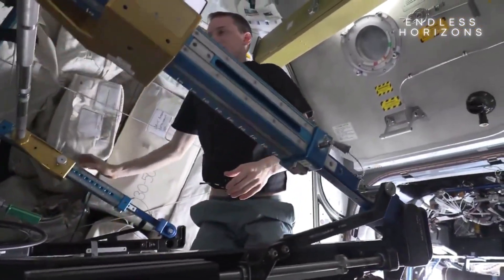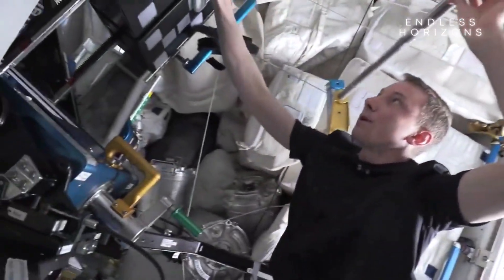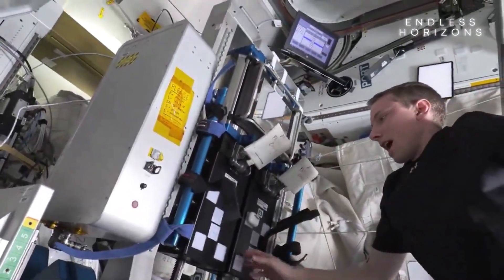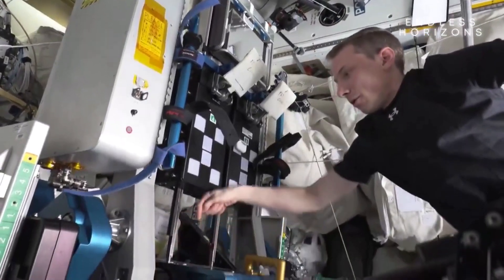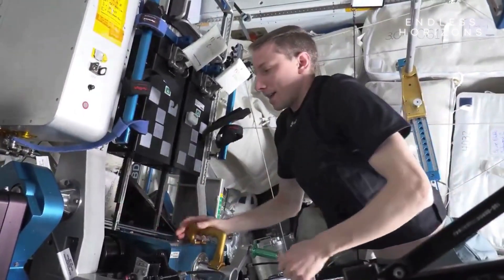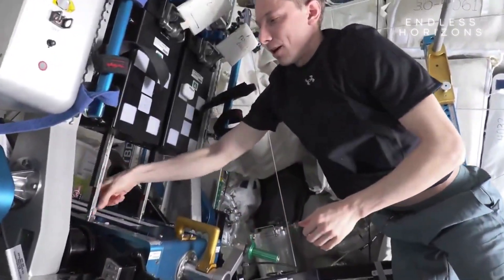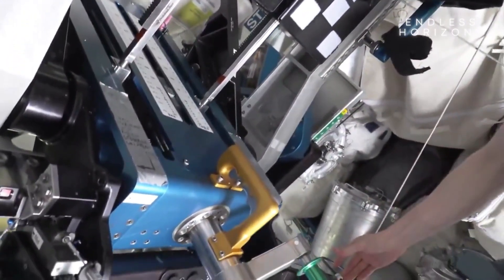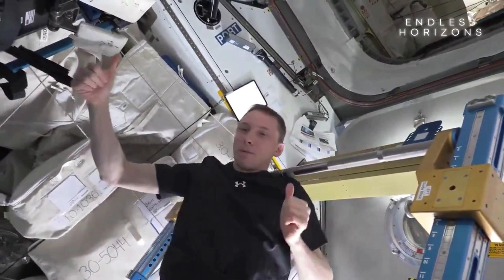The fundamental operating principle uses a pair of vacuum cylinders. Up here we have these 2 large cylinders, and inside these cylinders is a vacuum. Pulling open a cylinder under vacuum creates a lot of force. On these 2 arms here, when you pull down on those arms, that creates a lot of force — these are pulling upward. This whole machine is built around these 2 pivots right here. So as these arms pull up around the pivot, the rest of the device, including this arm and the bar that I lift on, are pulled downward. That pulls up, this comes down.